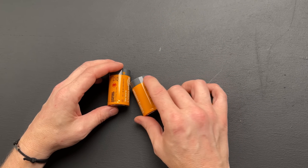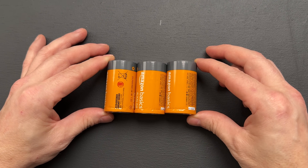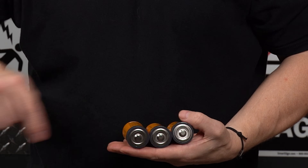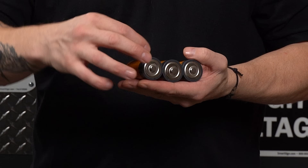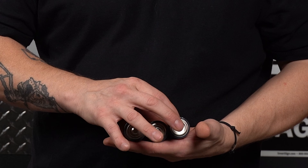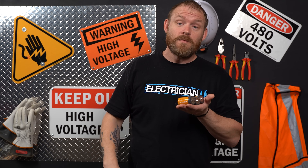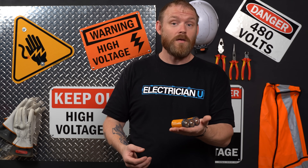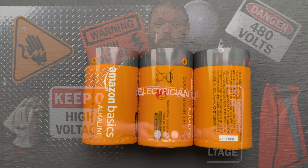Another really dangerous situation is when we put batteries in parallel. You take all the positives, connect them together and bring one wire out to the load, then connect all the negatives together and bring that out to the load. Now we keep the voltage the same — still only 1.5 volts — but we have triple the amount of current that can flow. If we short that situation out, connecting positive to negative, we have triple the current, which can be an incredible amount. It can burn the insulation off conductors and make the batteries explode. So whether batteries are in series or parallel, be very careful when stacking them.